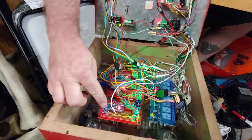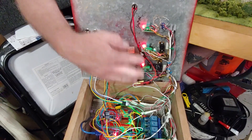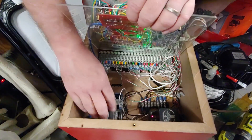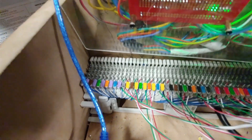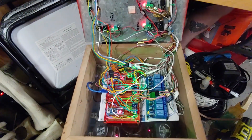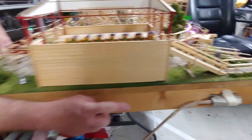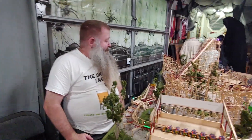Inside the box I've got my three Arduinos, a relay board, a bunch of speed controls and direction switches. Underneath are the power supplies for everything. I've got a 66-pair punch-down block which brings all the sensor and motor wires into this box, using an Amphenol telephone-style connector on the back of the box that runs over and connects to the same connector on the table.